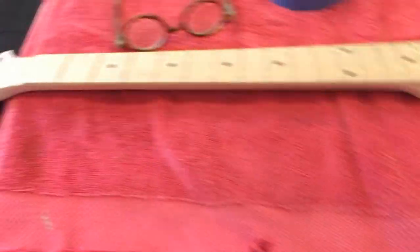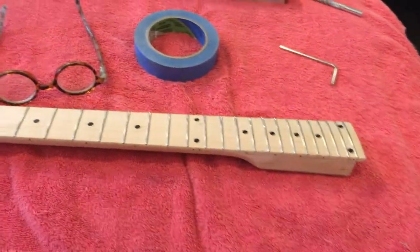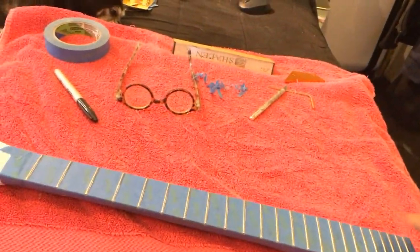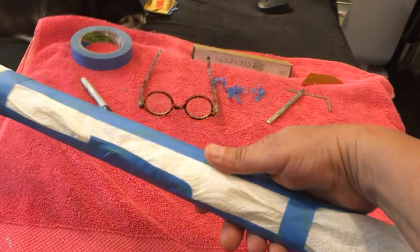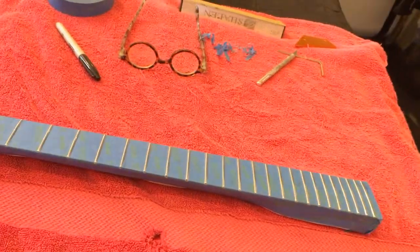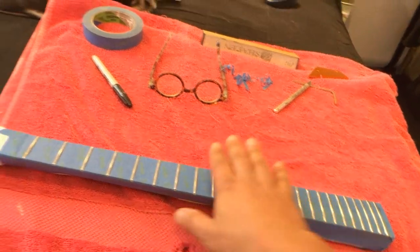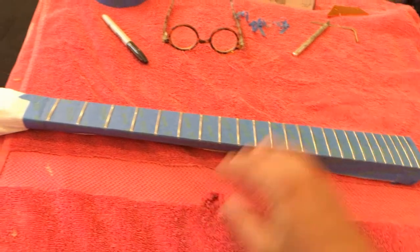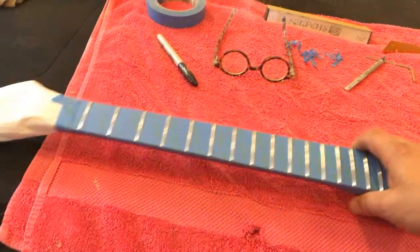So they're pretty cool. All right, next step is going to be to tape up the complete neck, and I'll see you when I get that done. All right, got the neck all taped up, and I took an extra step on this neck. Seeing how this neck's completely raw, I want to protect it from any fret dust, because when I do the leveling, crowning, and polish, the fret dust will come off,